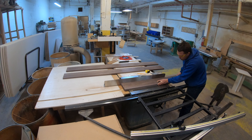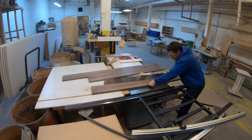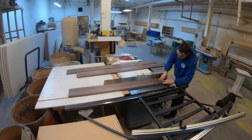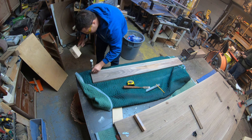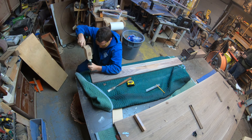For the first two pieces I was able to push them directly through, but I'm a little more careful on the third piece. The third piece is going to be at the feet of the bed so the end grains are protruding along the outside, so I need to both start the dado within the wood and finish it before the wood end. Afterwards I'm going to use a chisel to clean up that edge to ensure the steel can slide in without hitting the curvature from the cutting blade.